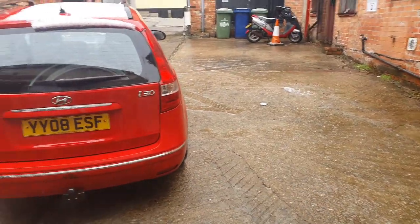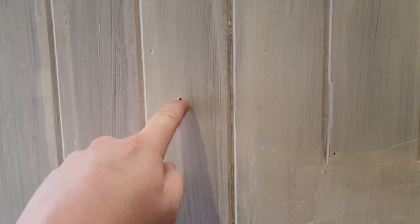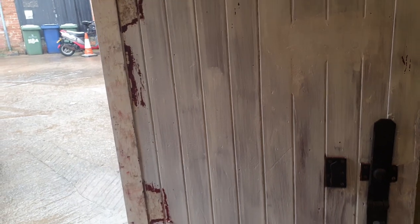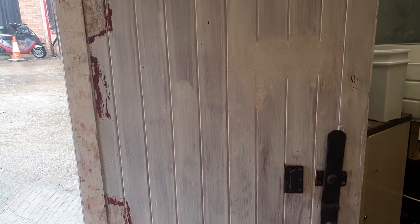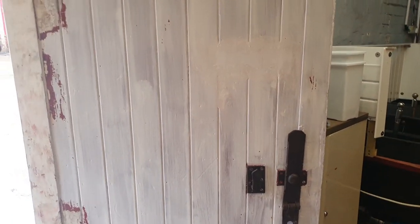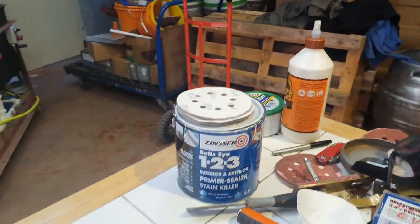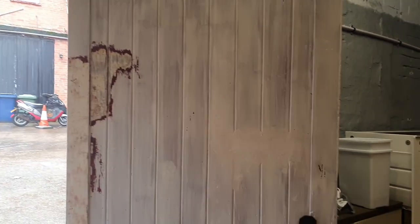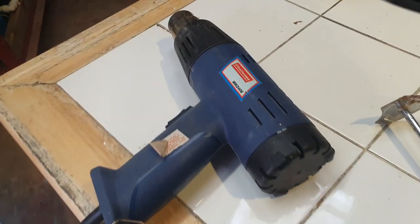It's not too bad this morning, so I've come down to work to check on the doors that we painted in primer. This is what I worried about — even though it is going off in certain places, it comes off really easily. We did key it all, sanded it with 120 grit, cleaned it off, and gave it a blast. But I don't want to risk over-painting it, spending a long time on a piece of artwork and then having it all just fall away.